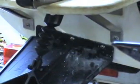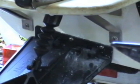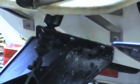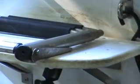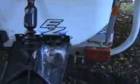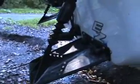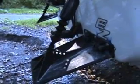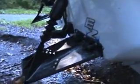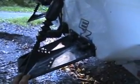As you can see, we've mounted the starboard smart tab on the back of the stern, and I had to notch out the swim platform in the back for the actuator. Here we're looking at it up in here. The smart tab has been applied to both sides of the boat. Now, from the side you can better see. I had to move the speed sensor and my transducer over about an inch to make room for the smart tab, which was no big deal. And the smart tab is really, really easy to mount.